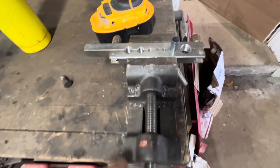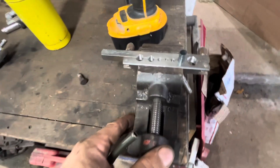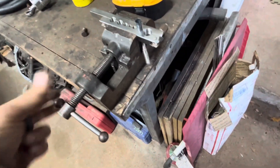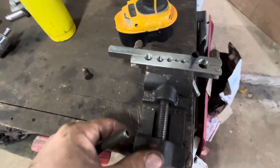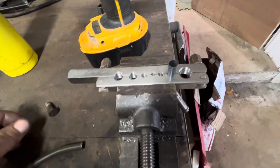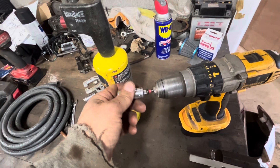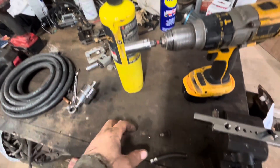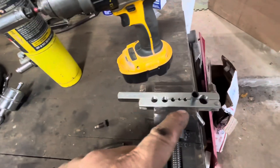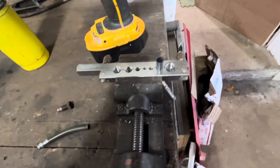Obviously it's better if you have a nice big bench vice - mine is broken right now so I'm using my machinist vice and it's not clamped down, but I think we can still get it done. I'm going to heat it up till it gets nice and red, then put the bolt in the drill - it would help if I put a socket on there like that. Put the bolt in there and just spin it, putting a little down pressure as I heat it up, and I'm going to swage the tube.